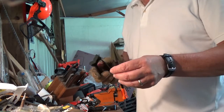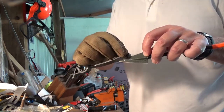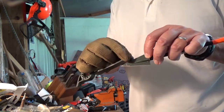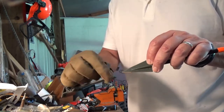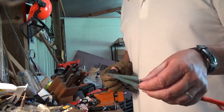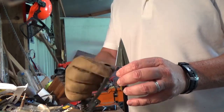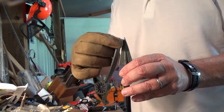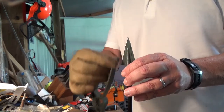So I'm going to use this tool. Typically I go about 25 or 30 strokes with it. Typically start with a point. Don't push real hard, just a gentle drag across it. You can feel it smoothing it out. Basically, you start out with a little bit of a grind, then you end up with a polish. You can feel it start to get smooth.